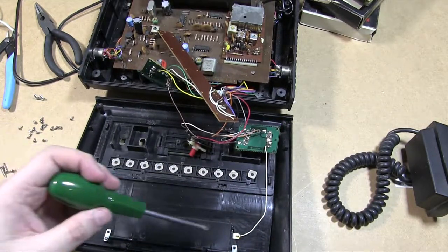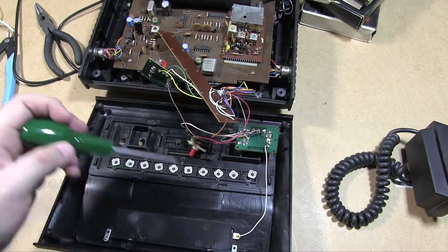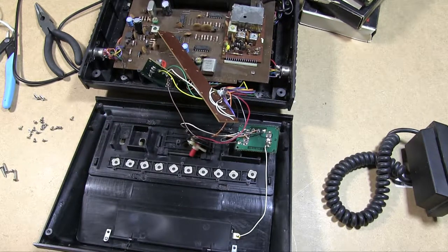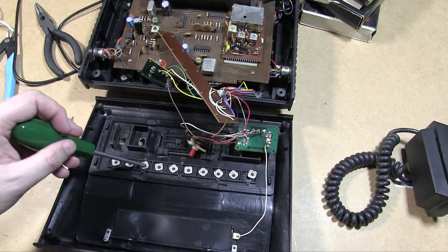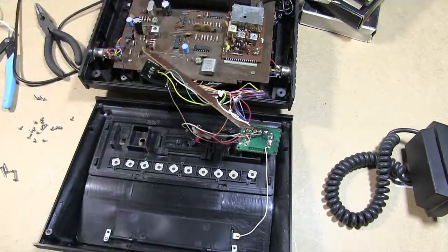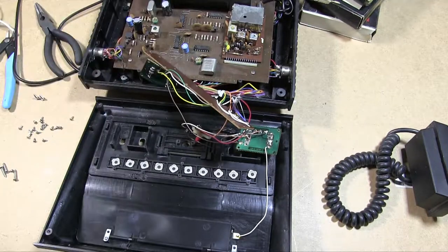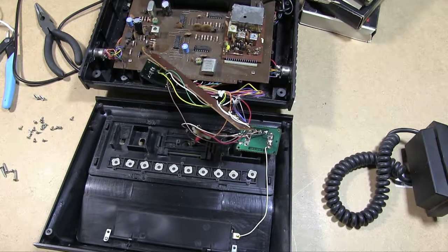So annoyingly the boards appear to use the aluminium covering as a grounding point in two places. So we're going to have to desolder that - that's quite annoying. This has all come away and you can see we've got these little push buttons here. They need to be cleaned as well. This board with the buttons pushed on definitely needs to be cleaned - that looks awful. This is not going to come out because it's plastic welded in. So cleaning this is going to be more difficult than I thought.